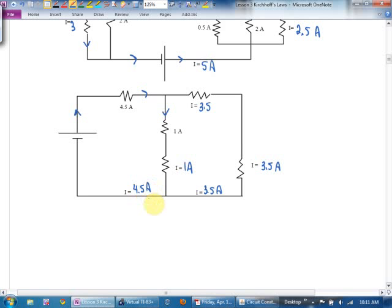So as long as they give you a little bit of information, you can hopscotch your way to filling out the rest. The nicest to find, you can see it falls apart as soon as you know total current. And so I almost always bend my efforts to find total current. That's Kirchhoff's law for current. It says that current in equals current out.